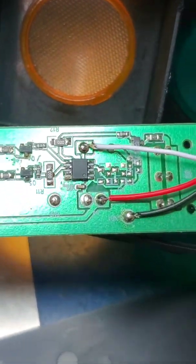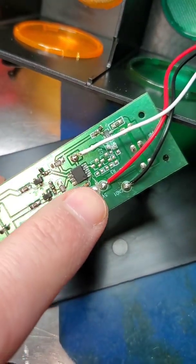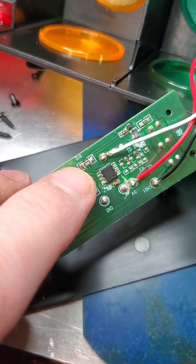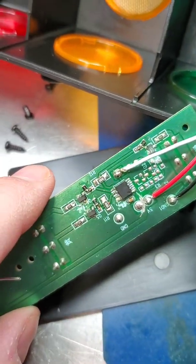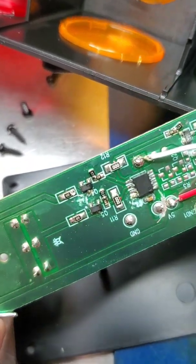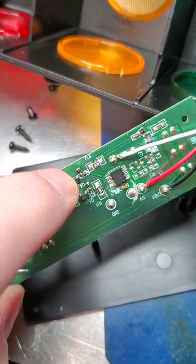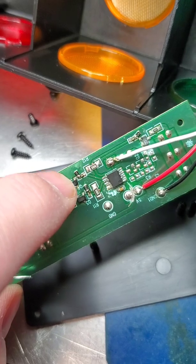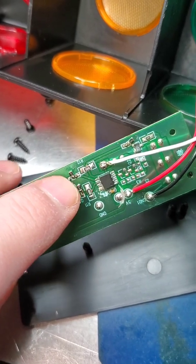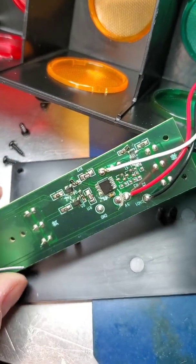It'll be easy to do. I'll cut here the power supply to the IC and add a few more resistors to wire my signals to the gates of the MOSFETs for the LEDs. I'll just put some 470Ω — I had it, it won't really matter, just enough. This won't draw too much to power the MOSFETs, so just for extra protection so it won't have any power come back to the MC.